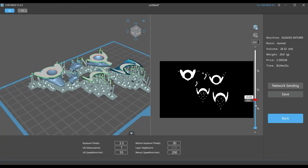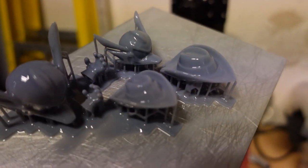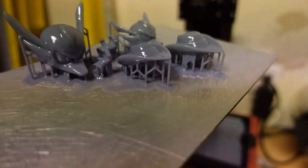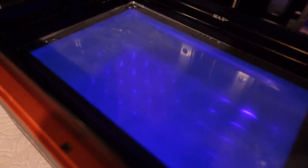With my printer, you slice the 3D model into individual images that are then solidified in resin using a UV LCD screen. I've unfortunately run into a problem here — this section keeps having extra cured material, and I have to empty out the entire vat between each print. I suspect the LCD in that section is going bad.